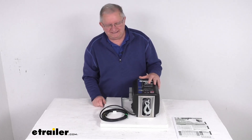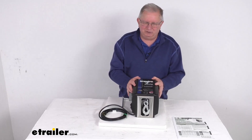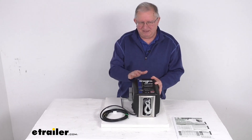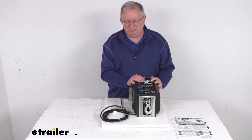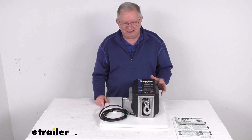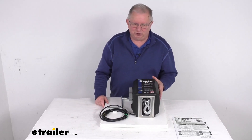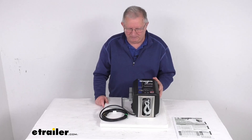The current draw on this is 6 amps at 120 volts. Electric winches should be used intermittently, because the maximum continuous run time should be only about four minutes. The load speed — on a no-load full reel it's 35 feet per minute, and on a full-load full reel it's 16 feet per minute.